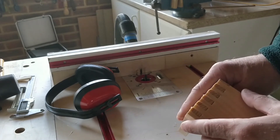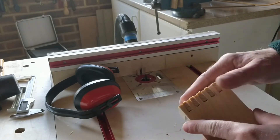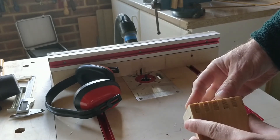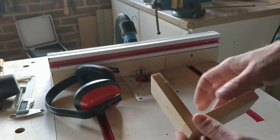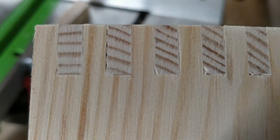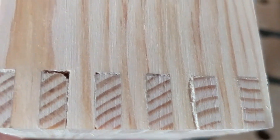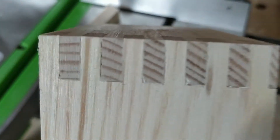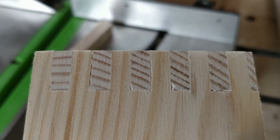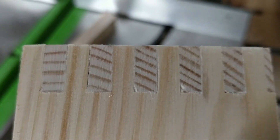So I'm hoping that's about right. This one looks slightly different to the rest — I think I must have slipped when I was holding the piece, because if it was a systematic thing they'd all be wrong and they're not. So I'm going to glue that up and then test it to destruction just to see how strong it is. Close up of my first ever box joint. There are some imperfections but I'm pretty pleased with how it's gone given how easy it was to do. There's a bit of chip out but it all can be filled. Given that it's quite soft wood and it's the first one I've ever done, I'm pretty pleased with that.